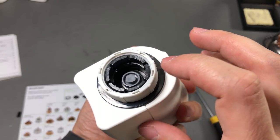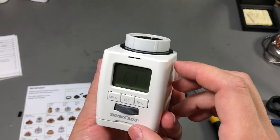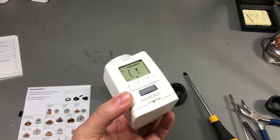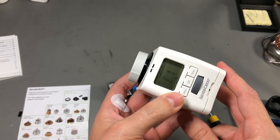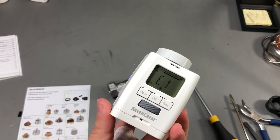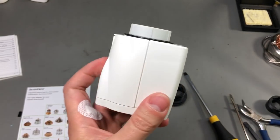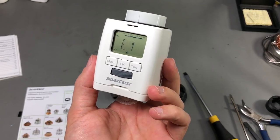Anyway, that doesn't stop us from continuing with the teardown just to see how this thing works. So far I know that gray part is a motor-controlled plunger, and I can hear the motor when I select install or adaptation from the menu. Apart from that we might also see a cheap microcontroller, maybe even a blob of epoxy, obviously a cheap LCD, a motor with the required driver — which could be an H-bridge for easy reversal of rotational direction if they use a DC motor. I'm guessing they use a DC motor because this is a cheap product.